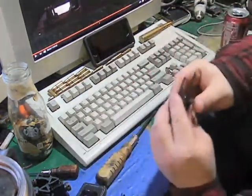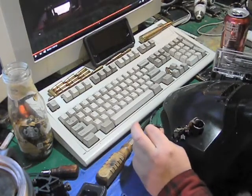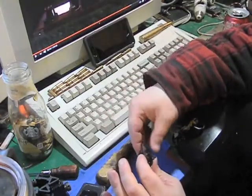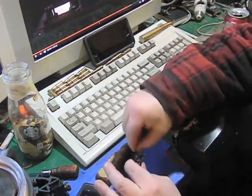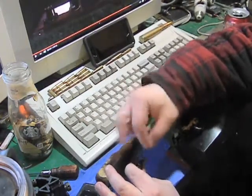So what I ended up doing, I had the pin the whole way out, and I had this little sear here removed, and to get up in there I took one of the half worn out sanding wheels from my Dremel, one of the larger ones. I cut it up with a pair of scissors till I had a firm little strip that I could stick in there, and then just matched the angle and rubbed it back and forth for a few minutes.